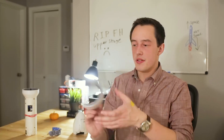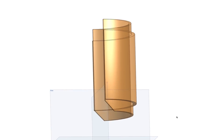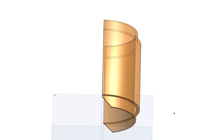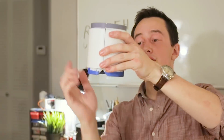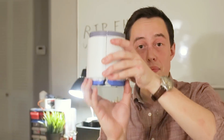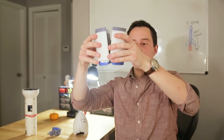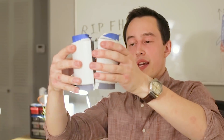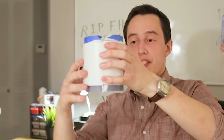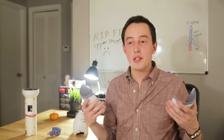Let's take a closer look at the two fairing halves. On the profile, one edge is just straight up and down on this little lip, and the other one is sort of chamfered — it has a slant to it. The reason you want this slant is that when the two fairing halves are together, you want them to be able to separate out cleanly without interfering with the circle that the base of the fairing creates. You can't expand this circle because it's rigid plastic, so you have to let these fairings contract and get closer to each other at the bottom. That's why you need this chamfer. If you try to do the same thing with a straight edge, the diameter of the bottom half of the lip expands — and that's a problem if the piece it's connected to doesn't expand. This is why the fairing didn't fully separate.